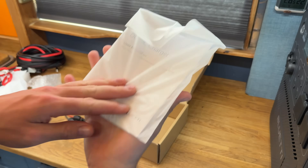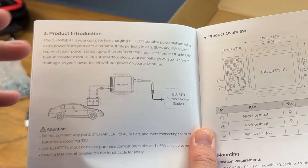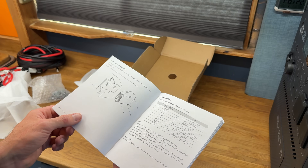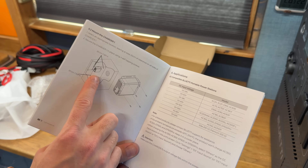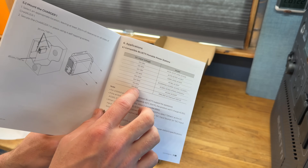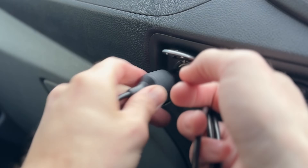That's pretty much everything in the box — rather simple. There's also a manual and a warranty card. Just to note: these are called alternator chargers, but you don't need to connect directly to the alternator. They connect to the starter battery, which is itself connected to the alternator. The manual also gives recommendations for ventilation distances and airflow — which most people will ignore and shove it in a cupboard, but things that get hot don't work as well. It also shows maximum solar inputs on Bluetti power stations, though these are the same for many other brands, since the MPPT controller just looks for a voltage and amps — the brand is irrelevant.